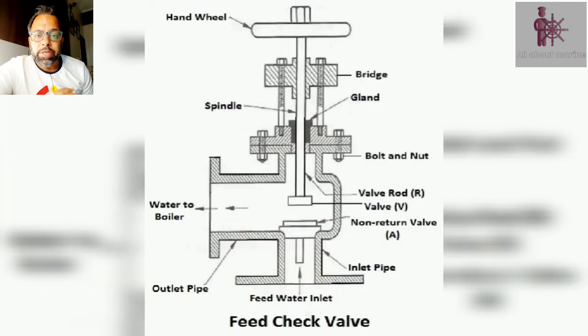Now as the steam is being used, the water level in the boiler goes down. So we need to supply more water to the boiler so that the water level remains at a normal level. Now since the boiler is at high pressure, we need to have high pressure pumps which can supply water to the water drum, and this is facilitated by a few valves which are known as feed check valves. These valves are mostly automatically controlled — a signal comes from the water level indicator and periodically these valves open and close to allow water to come into the boiler and maintain the level.